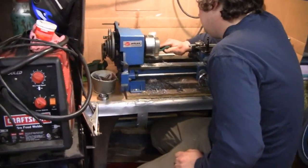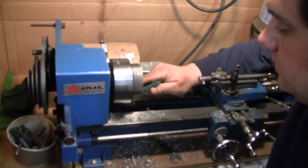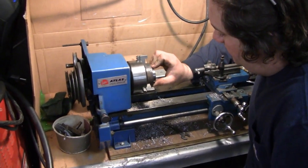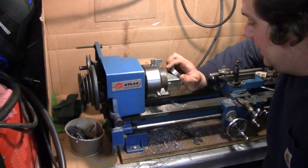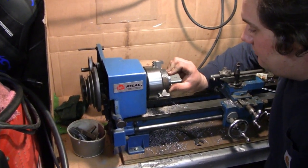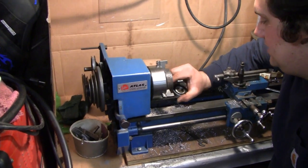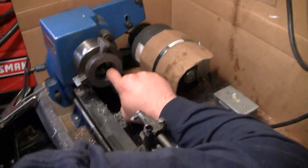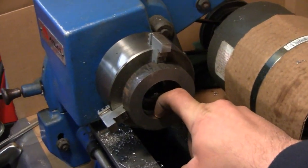Mike is just about done over here. He's refining the bore so that the bearing will be a press fit into it, like the other one was - just polishing it up and test fitting. We're at the point where we really don't have the tooling to measure the bore versus the bearing accurately, so it's just a matter of polish a little bit, see how the bearing feels in there, and maybe polish a little bit more - sneak up on it. You can feel some ridges in there yet and you can see them.